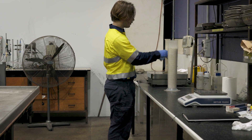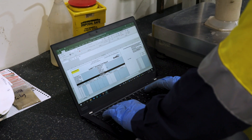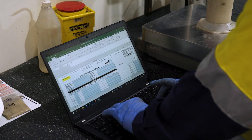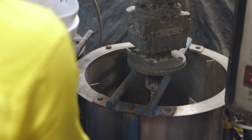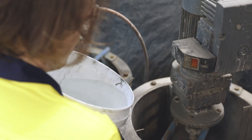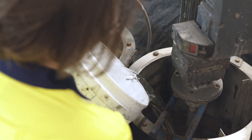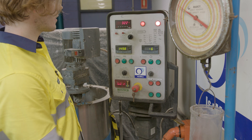Take the mass of the graded charge and the mass of the signature plot sample. Calculate the mass of water required to achieve 20% solids by volume. Glencore Technology will advise you, the lab, on the right conditions for the test. Add the required volume of water to feed tank A and activate stirrers within both tanks A and B.